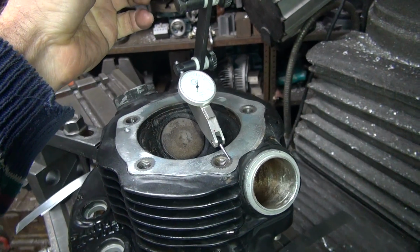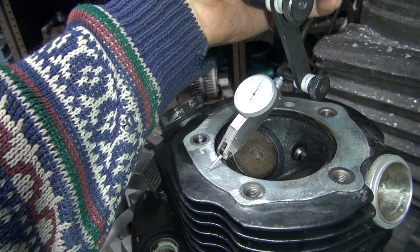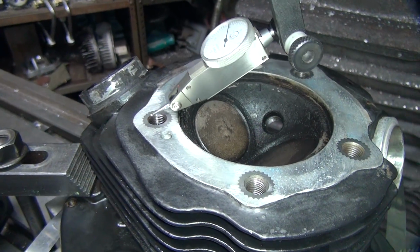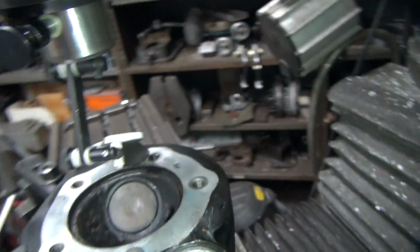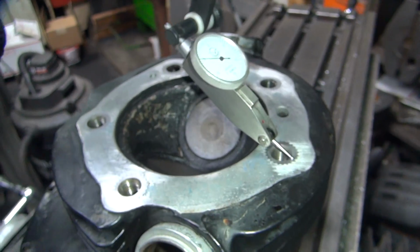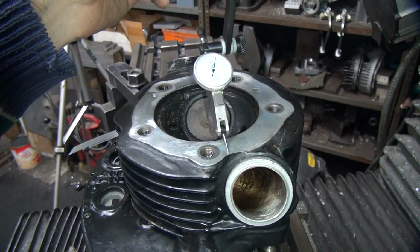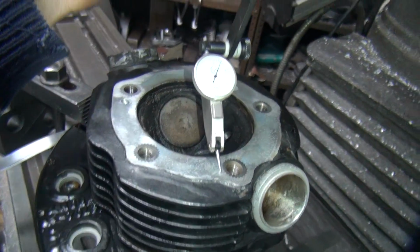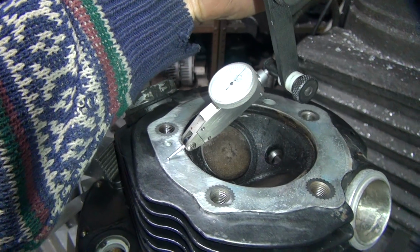Okay. We're about 8. Floating to about 0 there. We just went up 3. 3 under. Still 3 under. This head's not very flat. What do we got over here? We're not even on the scale over here. 0. Oh, we just came up quick. There's 8. So we're 8 right here. Or I have a 3 over, not 8. That's 3 over. We're 0 more or less through here somewhere.